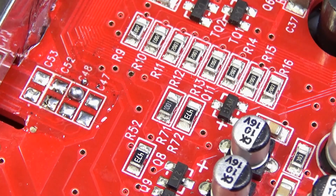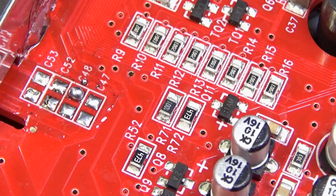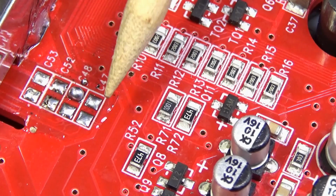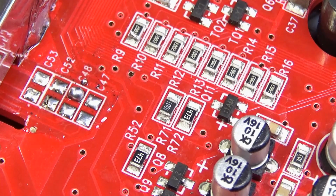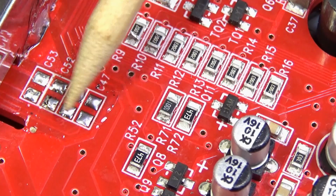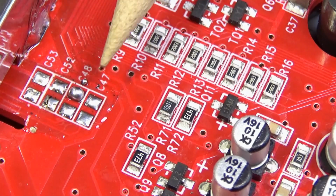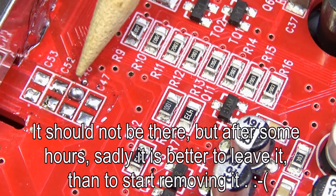Also, when we have reworks, when something has to be repaired or adjusted, customized for that board, depending on the requirement of the board, I cannot wash it. So the flux is there, and the flux will be neutral after 24 hours. Some of the flux even after 8 hours. So this flux doesn't affect anybody. Even if there was a solder ball there, it's trapped in the flux.